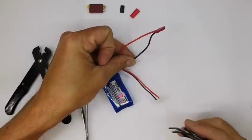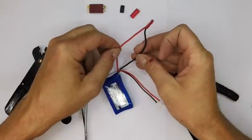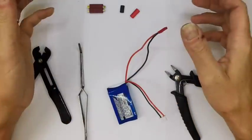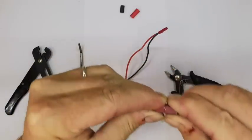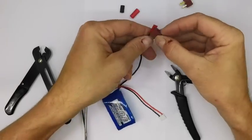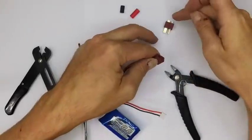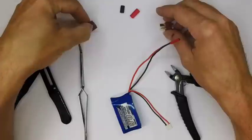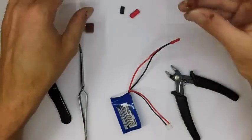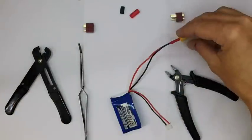The critical rule: never cut both wires at the same time. I can't stress that enough — do one at a time, fully insulate it, then do the second one. Like in Ghostbusters — don't cross the streams. You do not want to touch the two leads together. Similarly when charging your LiPo, keep the two polarities apart. If your charge leads terminate in banana connectors, do not leave them exposed — you risk shorting the pack. Plug everything into your charger first and don't leave any naked wire.